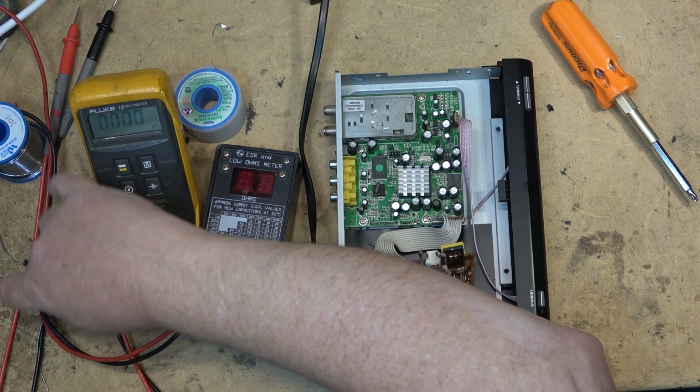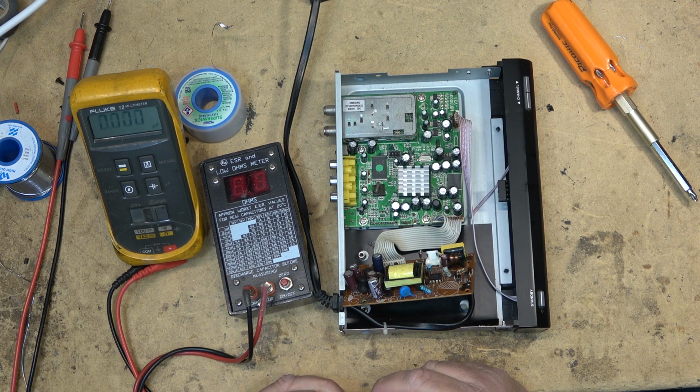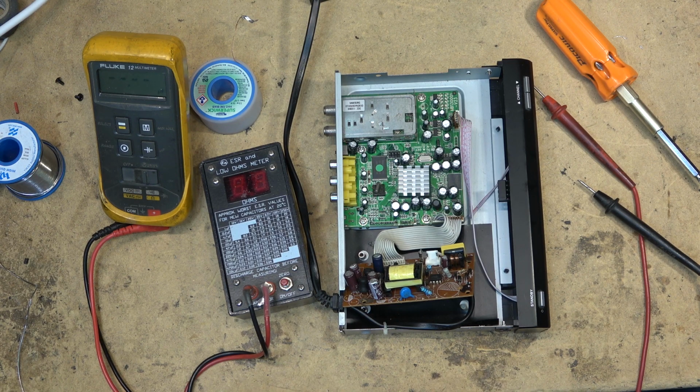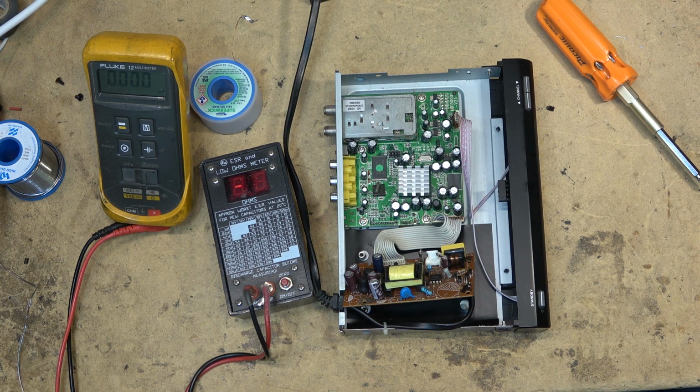Okay, let's just check this one out. We'll measure its capacity first with the capacitance meter. And 33 at 400 volts. Make sure I got the right probes. So it's measuring. It's getting there. 29. 27. So it's measuring a little bit low. Check the ESR on this one. ESR showing completely open. So this cap is dried up.